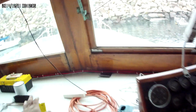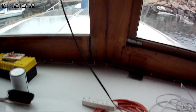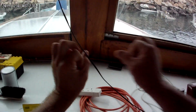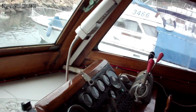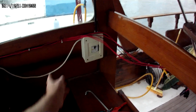But then again, as I said, I had the surveyor stop by, because I wanted to know how I could cover this up. He happened to be at the shipyard the other day when I was there, and I said, come on over, I want to ask you a question. He said it's low voltage and the wires are oversized for what they're doing, but to cover that up with wood, I need to make it removable up to this point and over to this point. I have to get some kind of cosmetic little cap on that wood so it looks like I can actually move it and put it back. Then I'm up to modern day code from what the Marine Department says I should have for my low voltage from my panels. So that comes around, and then those will drop in.